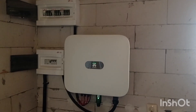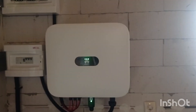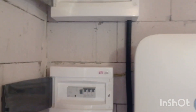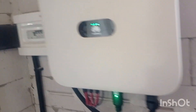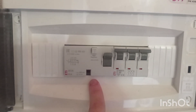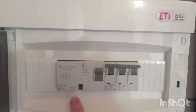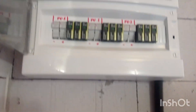Here in the garage I have the grid-tie inverter — a 20 kilowatt Huawei — which works with 30 kilowatts of panels, working absolutely perfectly fine. The key difference is it doesn't have any DC switch. But it does have a standard AC switch together with an additional differential-type protection.